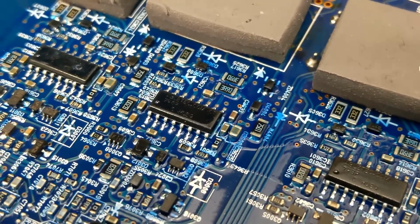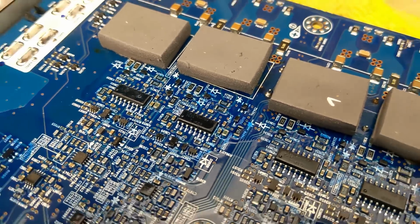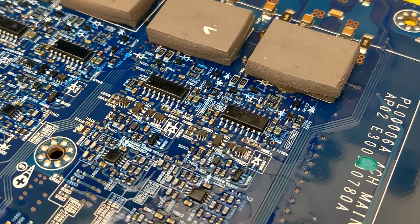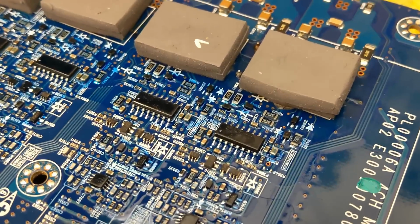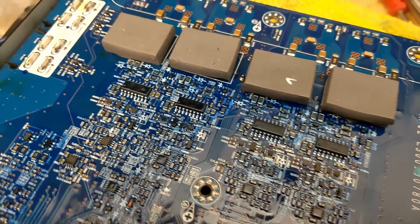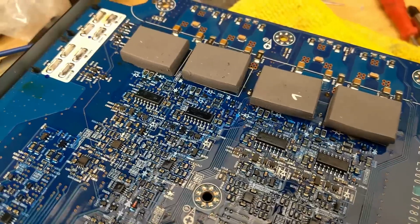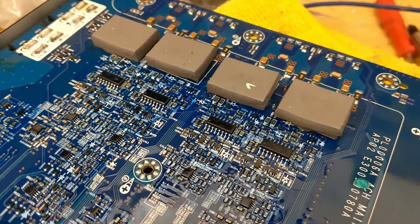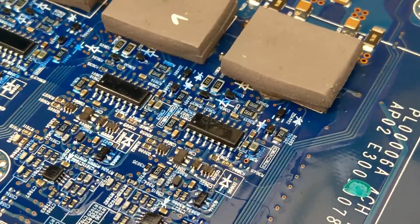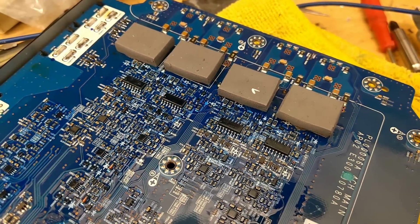These are labeled abletech.com. You will struggle to find anything online about these. That's because they are an Alpine proprietary component by the looks of it, at least by some merit. They are basically an IRS20956, which is almost identical to the 20957, but with a couple of the pins flipped around, so they're not compatible. You can't drop in a replacement with a 20957, and I think they have tiny differences in functionality as well. But you can't buy these. The 20956 doesn't officially exist. There's no datasheet you can find anywhere for it. However, you can buy them from the likes of AliExpress or other Chinese vendors.